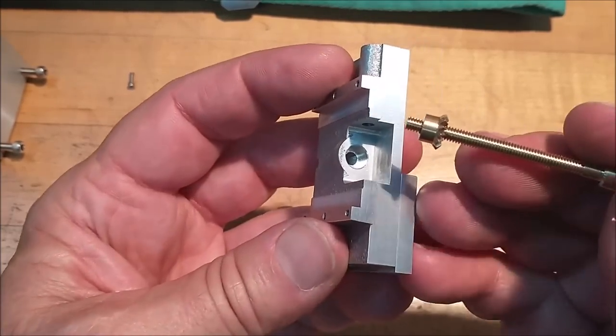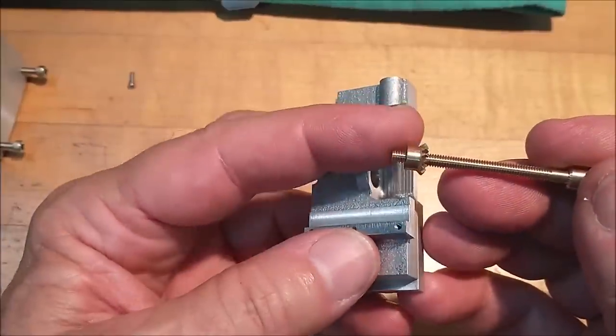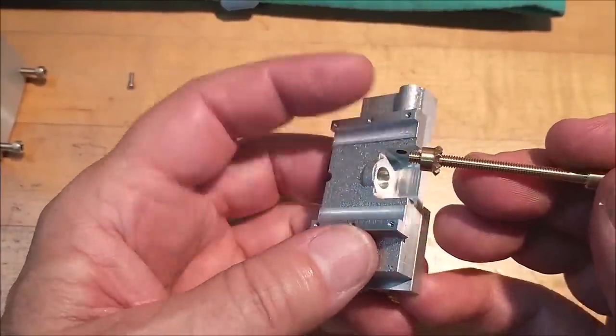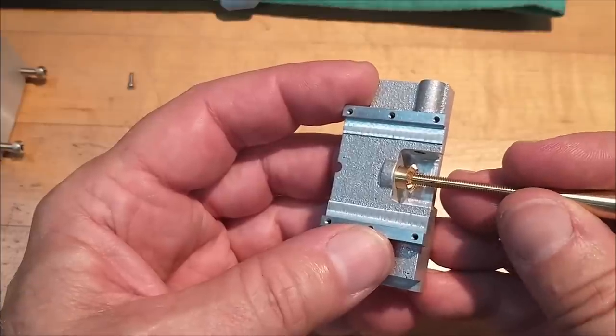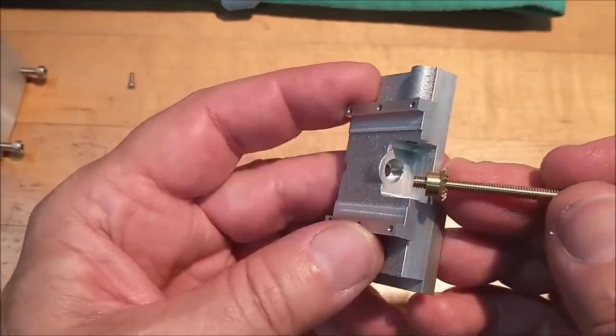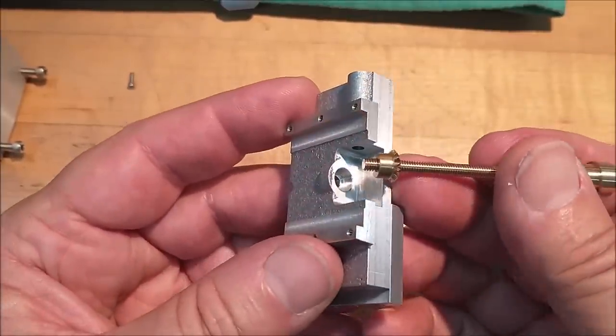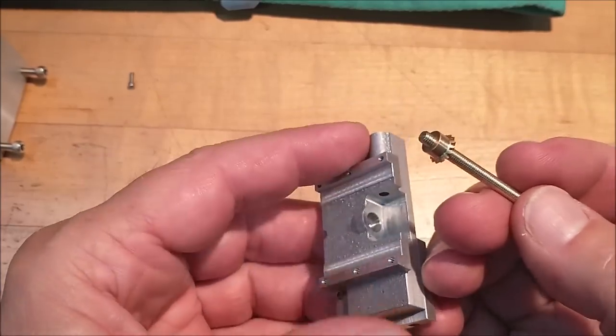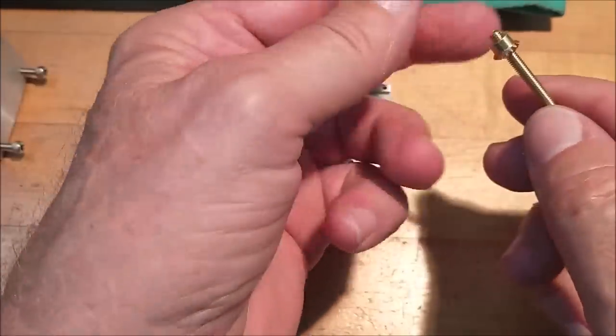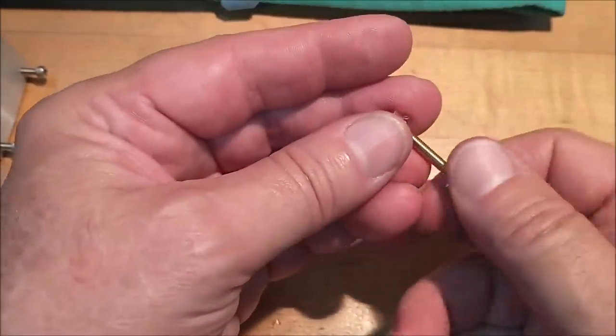But it doesn't tell you on the print is this counterbore has got to match the back of this gear perfectly. That is a 250 counterbore. And lo and behold, this is a 252 diameter on the back of this gear, so that does not fit. Note to self, guys, if you're going to do this feature on this casting, make sure you have that bevel gear handy when you do it.